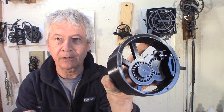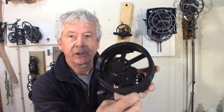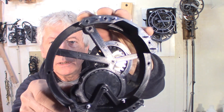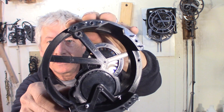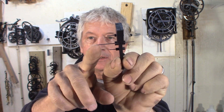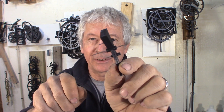Here you can see the rewinding mechanism — the spring is hooked up here, and there's a ratchet for rewinding. New plates with 1mm diameter holes. That's getting challenging — I cannot just push a 1mm shaft like this, it bends. So I'm going to start making some tools to assemble the watch. Making a clock is easy; making a watch is another level. But if I can manage to do a decent watch, I'll certainly be able to do much better clocks.